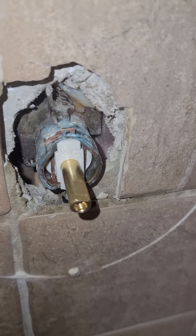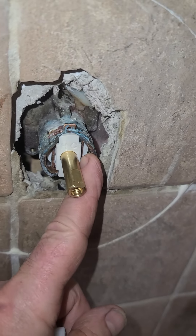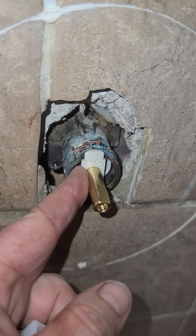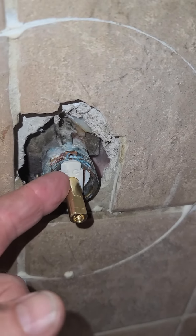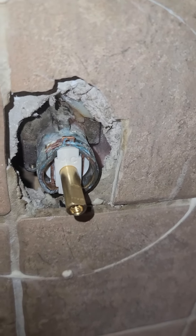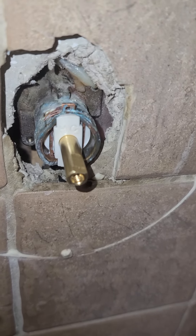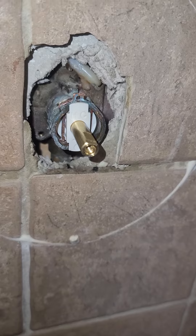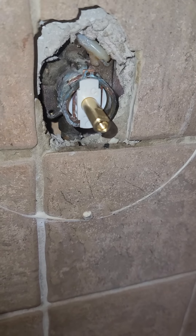When that happens, it's not the end of the world. My solution was to get my soldering iron out and run the hot soldering iron along the thinnest portion of the walls to the point where I could collapse the top and bottom with a pair of pliers and pull it out. The reason why it gets stuck is because that rubber sheath gets stuck into the brass component back there. The most important thing when you're trying to take this out is not to score, scratch, or damage the inside of that sleeve. That's why we used the soldering iron instead of something that would have scratched it — like a drill or some other power tool. So that's the deal — how to repair a failed installation of a Moen shower valve. I hope you enjoyed this and it saved you a little grief. Subscribe if it did, otherwise share it with someone who needs the information.